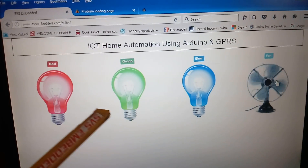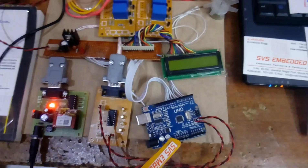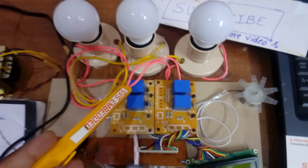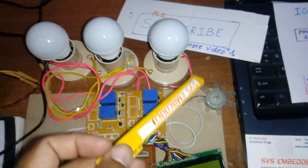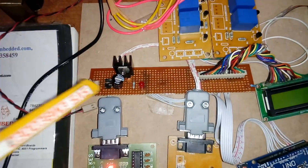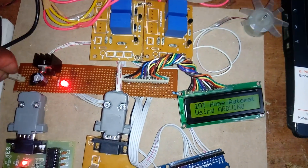This is the hardware — the ATmega328 Arduino UNO R3 board with SIM800L and four SPDT relay coils. Relay one through four control the red, green, blue LEDs and one DC fan. The power supply takes 230V AC input through a step-down transformer giving 9V AC output, through a bridge rectifier, filter capacitor, 7805 voltage regulator, and one LED indicator. Data is displayed on a 16x2 character LCD display.